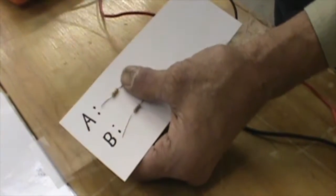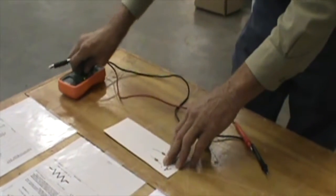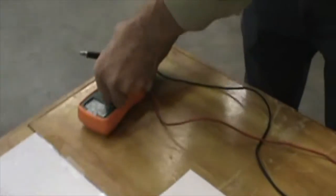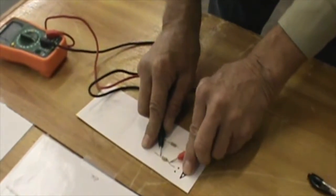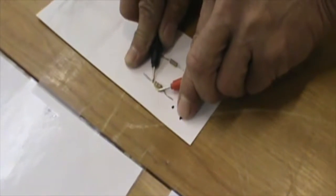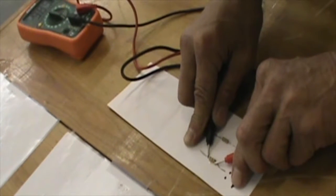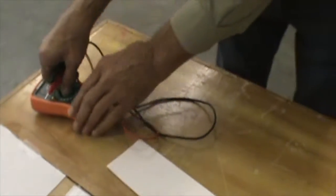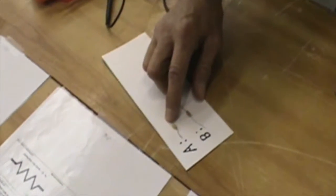The second question asks if the resistor is within the indicated color code range. We're going to utilize the DMM and check it with the multimeter. It is approximately 98.4 to 98.5 ohms. By the color coding, it's a 100 ohm resistor, so that's well within the 5% tolerance. We've already answered that resistor A is 100 ohms. That is correct.